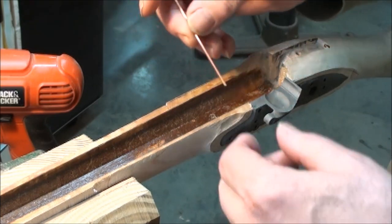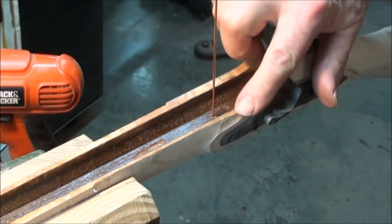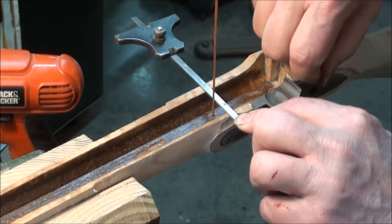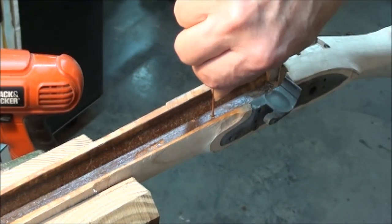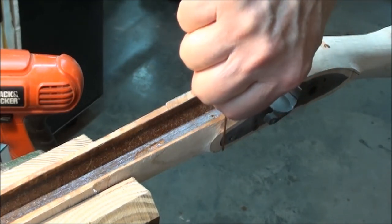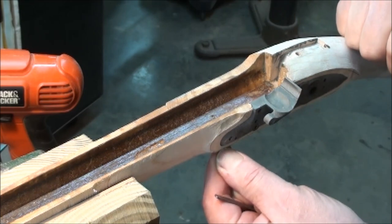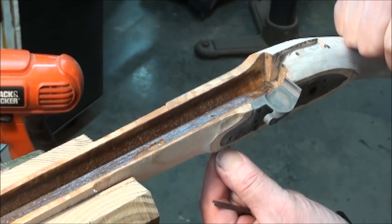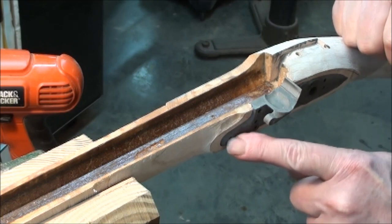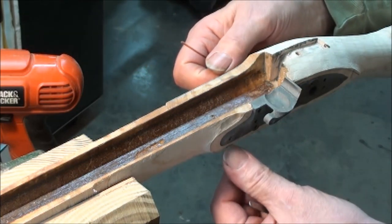Next, take a piece of 1/16th inch wire, set it in there until it hits the bottom of the ramrod channel, then look across level. Put your thumbnail right where the two sides meet and that gives you the depth. Then hold that up against the side and mark the stock where the bottom of the ramrod channel is. If your channel is 3/8 of an inch, measure above that 3/8 of an inch and you've got the top of your ramrod channel — that's the lowest you should put your bolt. If you're using a 5/16th or a tapered rod, the same thing applies: make sure you get enough distance.